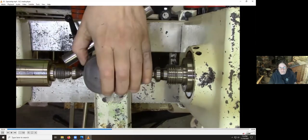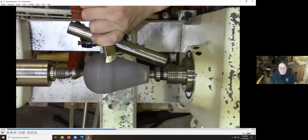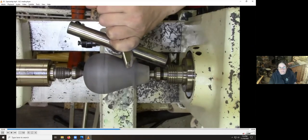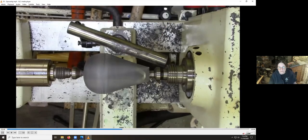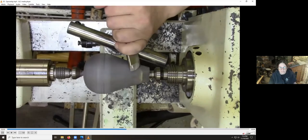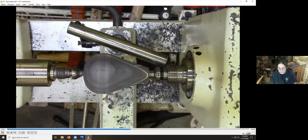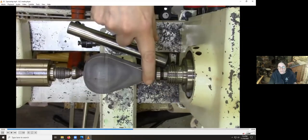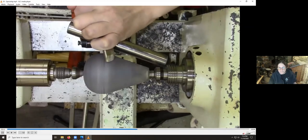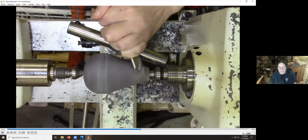I've gone from a spindle roughing gouge to my spindle gouge to get the final shape. I take down the nose to its final dimensions — I do this all by eye, I know the kind of shape I want and I generally don't use templates. I'm going to use a skew chisel — I think a roughing skew — to get my body section really straight. I'm using a ruler just to check: if there are any gaps under the ruler I know I have to take off more material. I really like this skew for doing this kind of work. I've made a lot of rockets in the last 15 years.